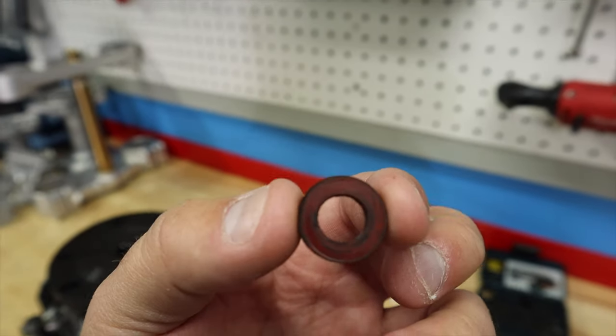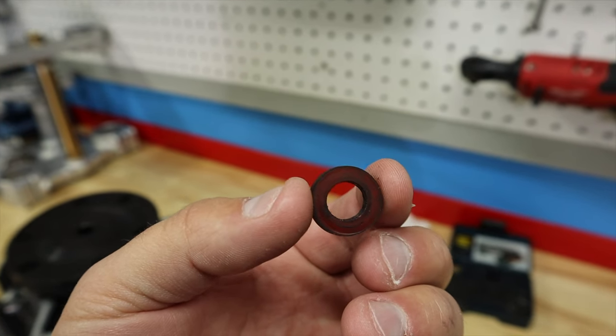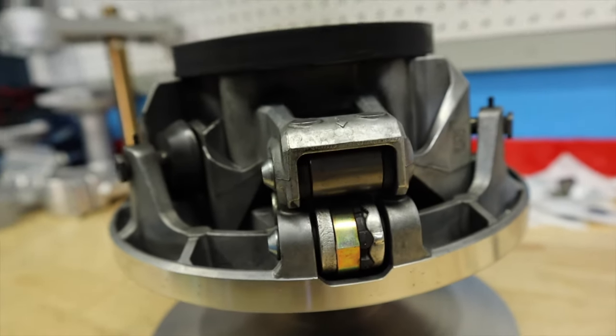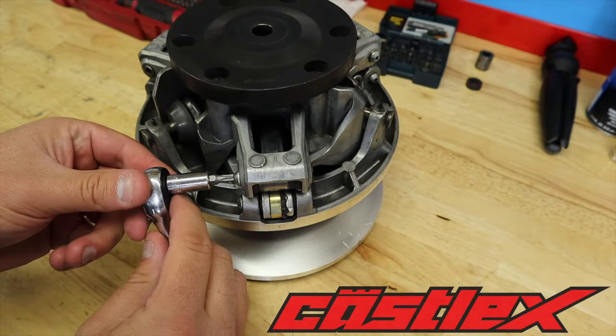And here are the bushings — they don't wear out near as bad, but this one is past its life. So we're going to put new ones in too. That's the new one, that's the good one. We are going to replace the other two. At this point, we are ready to take out our roller — T25. And whenever I'm doing stuff like this, it's a little bit more delicate. I don't like to use an impact driver — anything like that on it. We're going to just use our quarter drive wrench and be light with it.